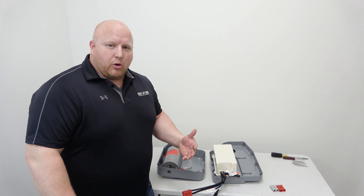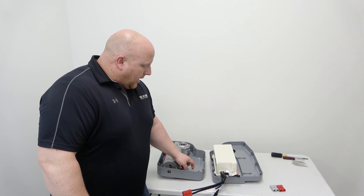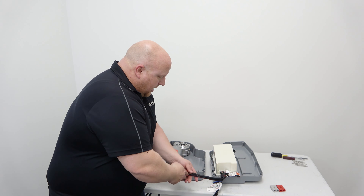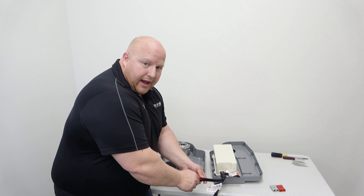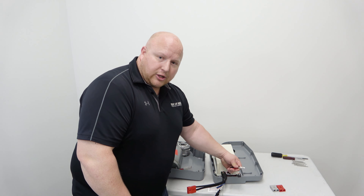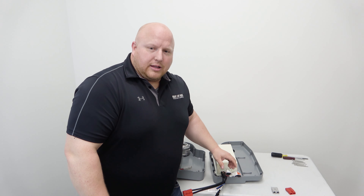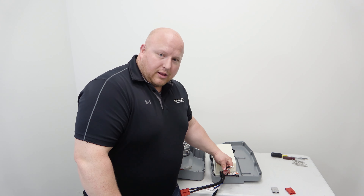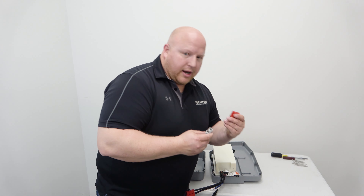On the first run of the motors we had a red connector, and now we have changed the connector to a gray. The reason for doing this is so you don't accidentally hook them up incorrectly. You don't want to hook up the power supply connection to the motor, or the electronics connection to the battery — it can cause major damage to your batteries, the unit itself, and the motor. So what we've done is sent the front covers out with bare leads, a gray connection, and a red connection.